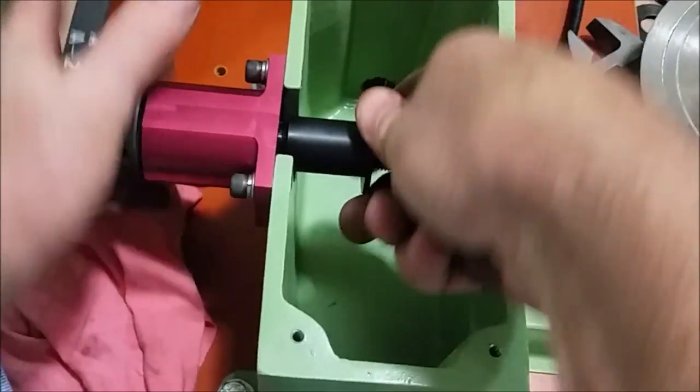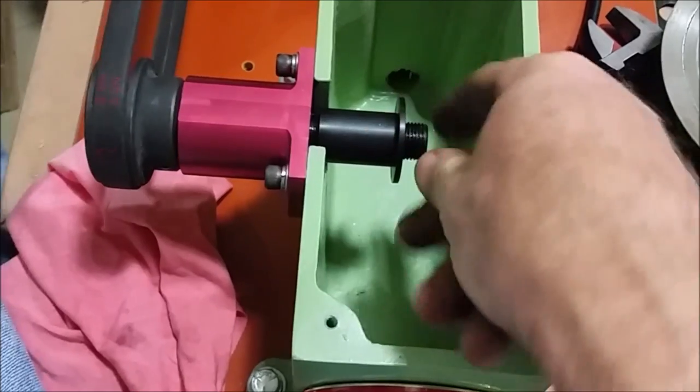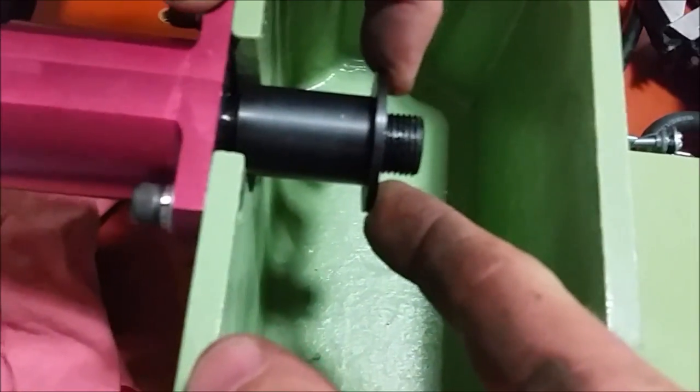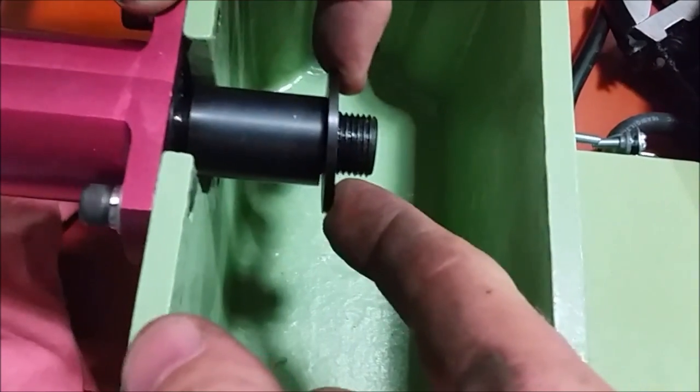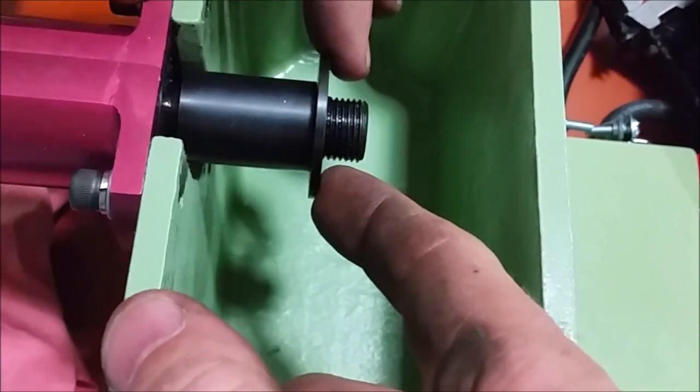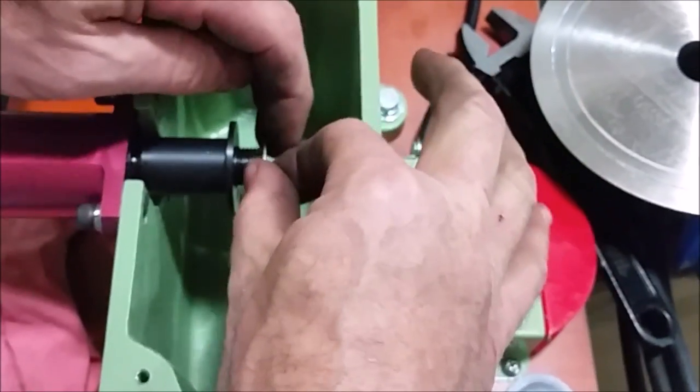What I like to do is wipe it off really well and feel it. When I set the flange on here, if I push back and forth I shouldn't feel it rocking — it should be sitting solid. So now I'm going to try putting everything back together.